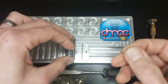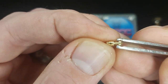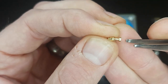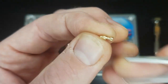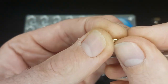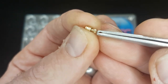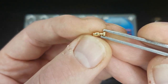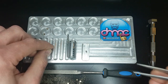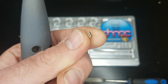The way we're going to do this — we've got two sections to manufacture. First we'll do this outer section: we're going to take a pin and hollow it out, but obviously not all the way through. Then we can see about making the second section and putting the two together. So let me get a setup in the Dremel and we'll try to make that first section. I've just selected a blank key pin from one of these sets here.